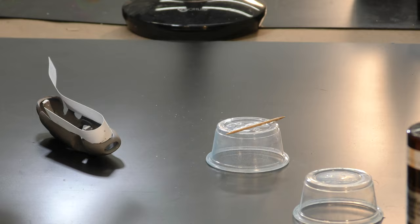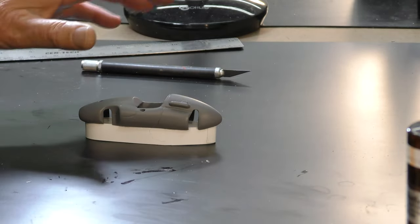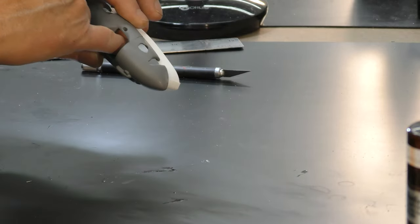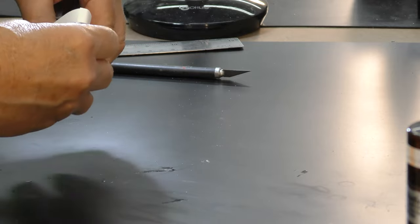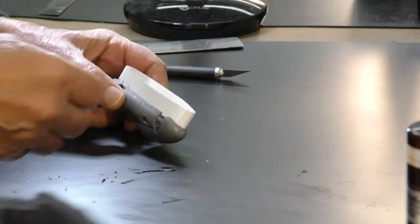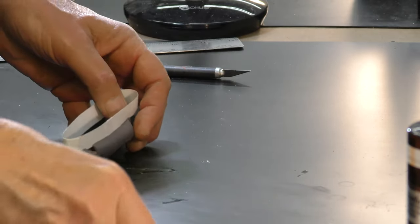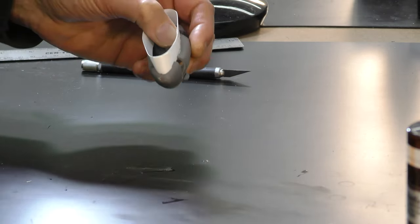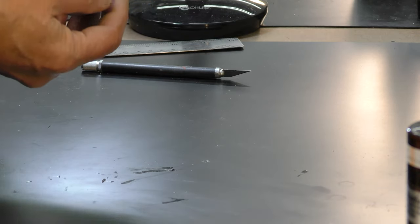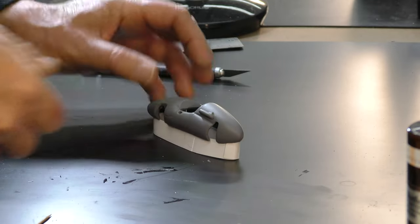And this is going to be what will raise this off the table. You can see I got this on pretty clean — it sits pretty flat, and that's what we want. But we have some more issues. All these openings really need to be filled, and then later removed from the inside when the mold is done. We are going to have a bit of a lip here inside the core — that's going to be challenging to get out. The thing about silicone is if it can find a place to leak, it will leak — it's tenacious that way. So I'm trying to make sure everything's sealed up very well, with no gaps. One thing you can do is fill it in with CA. That's better — we sit level, that's what we want.